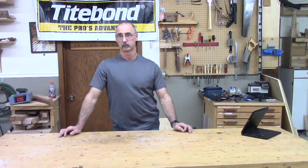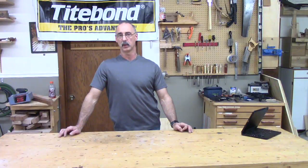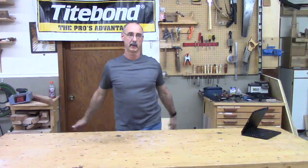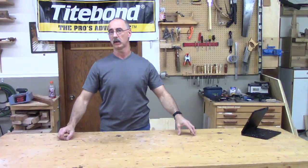Okay. So Charles wants to know, what is the correct moisture content to start a project, or does that actually vary by wood species? It doesn't vary by wood, it varies by how the wood was dried. So in broad brush strokes, material that's been only air dried will dry to 12 to 14%, and stuff that's been kiln dried will be around 6 or 8%.